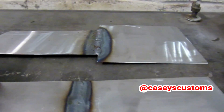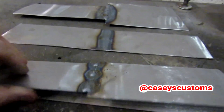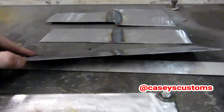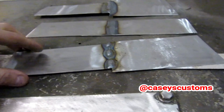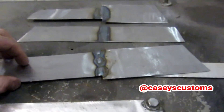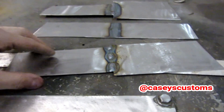When you look at a MIG weld, look how much needs to be ground down. Here's the piece I stitch welded — it had a little bit of a warp in it — but what I'm going to do is hammer it flat, finish welding it so it's fully welded, hammer it smooth and flat, then grind aggressively and see how much it warps from too aggressive of grinding.